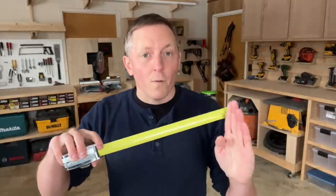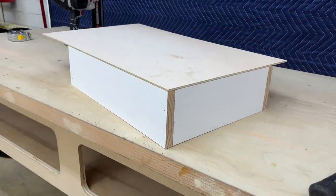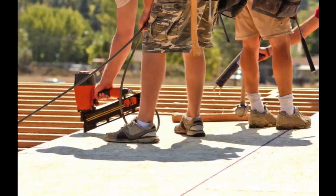To round things up: when you're pulling measurements on sheet goods, always be sure you're pulling from the factory edge — it's the only reference point you can routinely trust. And if you're looking for a fast way to square things up, consider the perfectly square edges and corners that come with your sheet lumber. They can help you in so many different applications.